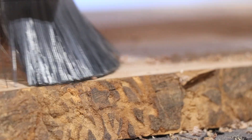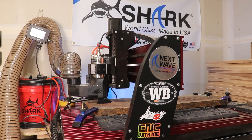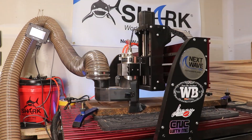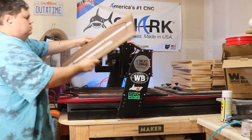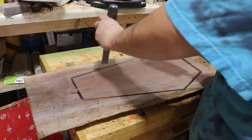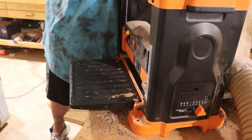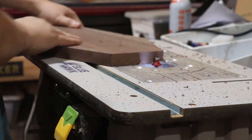You can do this with whatever type of wood you have laying around. In this case I have a piece of walnut that I had laying around the shop. I'll put it on the CNC and have it quickly cut out the coffin shape for me. Once it's done I'll pull it off and give it a good slap to get rid of all that dust. Using a hammer and chisel to take care of those tabs left over from the CNC. Then I'll run it through the planer to take it down to the proper thickness, and then it's over to the router table to give it a quick round over.